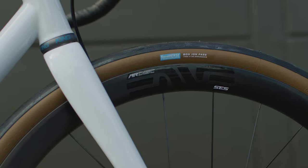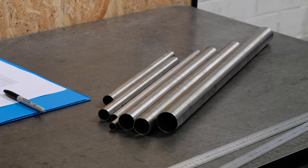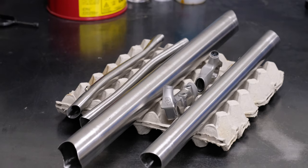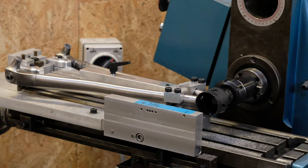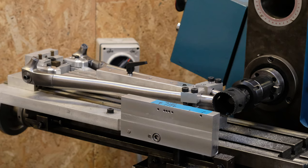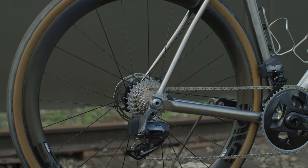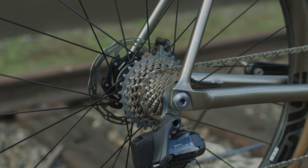It'll run up to a 38mm tyre. The tube set itself is something that we make in-house for each bike. I start with Grade 9, 3-2.5 tubing. The chainstays are always a particularly interesting part on a titanium frame. We start with a 1-inch straight tube — it's externally butted, then gets ovalised in a die and press, and then my tube bender made some custom dies and created the S-bend from that.